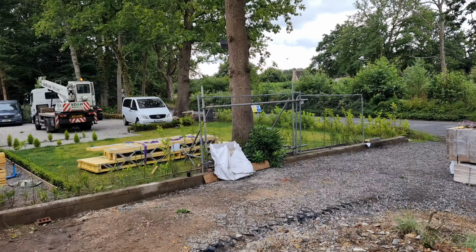So we've got a couple of joists put in. These are the joists that go on this end, and we're going to land the first truss against those so we know that they're absolutely parallel to our joists, which we're going to fit in. Crane is on the drive now, so we're in position.